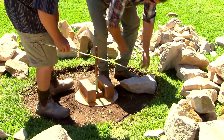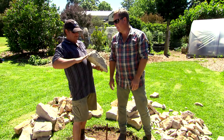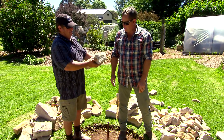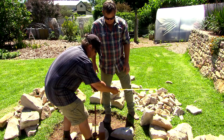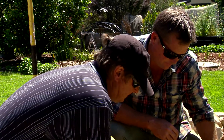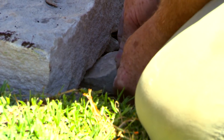Have a look at the stone first — you can see the stone has a batter on the face of it. Our stone wall has a batter on the face, so we want to keep the stone consistent with that batter, making sure we put them down accordingly. Then we use our measuring stick to make sure we keep it in a nice circle, packing wedge stones underneath to ensure they're secure.